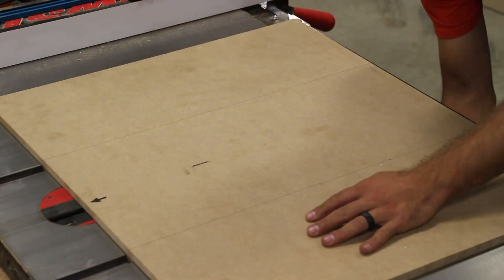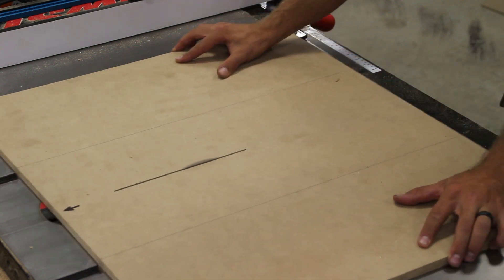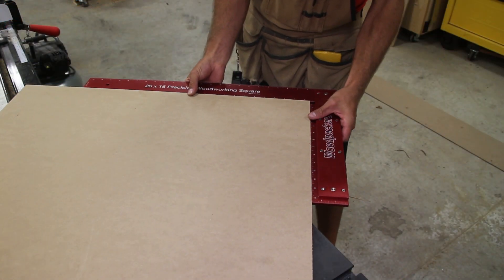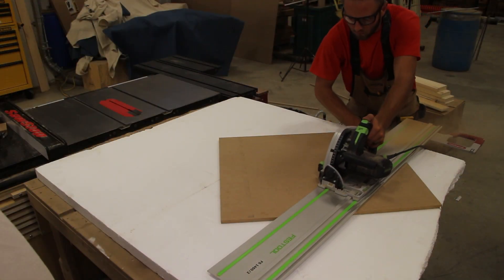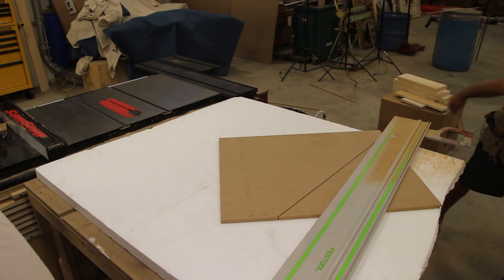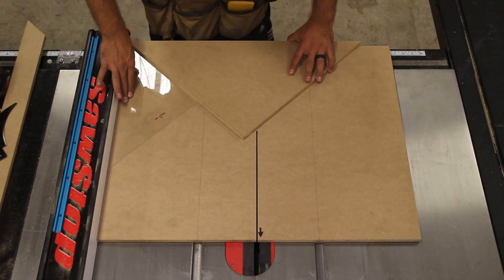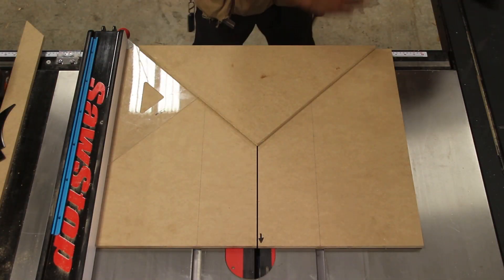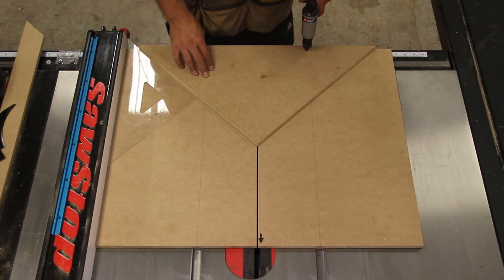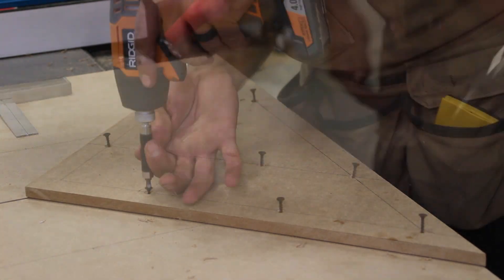I apply some paste finishing wax to the runners to make the sled nice and smooth. I raise the blade through the sled and make a small cut to register the fence on. It is vital your fence be 90 degrees square. I use a large square to check and mark a perfect 90-degree corner and then use my track saw to cut a triangle section. Butting the table saw fence up against the sled, I use a drafting triangle to get the fence at the right angle and perfectly on the saw kerf. I then use some pin nails to keep it in place while I pre-drill and drive some screws to keep it in position. It is important that this fence never move or the jig will be ruined.